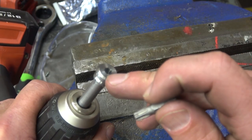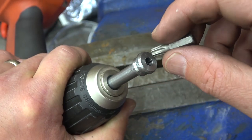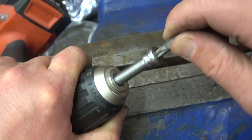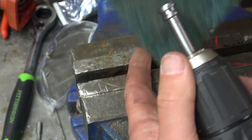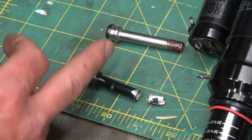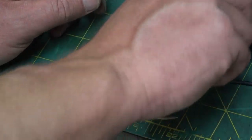Torx — very light broaching, meaning this is torque-limiting. You'll strip this out if you try and reef on her. Part of the reason I did that was because I was dumb and I threaded that hole prior to actually broaching — of course that broach makes a big chip when you've got that hex in there. The bottom is all covered, I'd have to re-drill and re-tap it. Seeing as how this is only going in but the one time and never coming out, I thought I'd just use the Torx. Get her chucked up in the chuck, clean it up, tidy it up, and then we'll paint it black — no one's the wiser. Old pin from Germany: fucking garbage. New one from Canada: skookum as frig. I'll even put some red Loctite on there — I'll tell him to heat the bolt up before he tries to get it out, but what are the odds he remembers that?